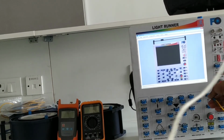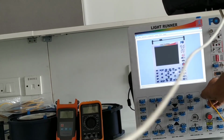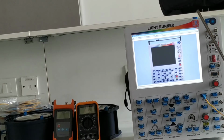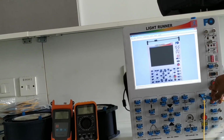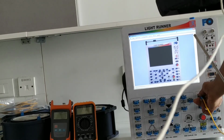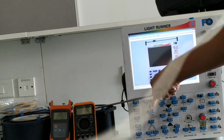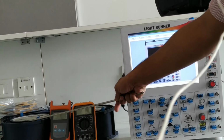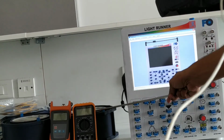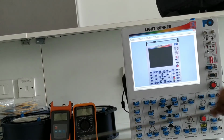You have these mechanical constructions, for example grooves and spring-like attachments. You have to push it, and you will hear a sound like a tack. Then you will know that this end of the fiber optics here and the other end of the fiber optics inside the system are in close proximity. You can also remove them by pushing them out. We also have larger fiber optic cables, of 1 kilometer, 3 kilometers, and 2 kilometer length. Again, there are connectors at the two ends of the cables.